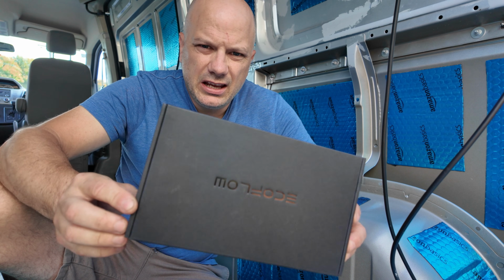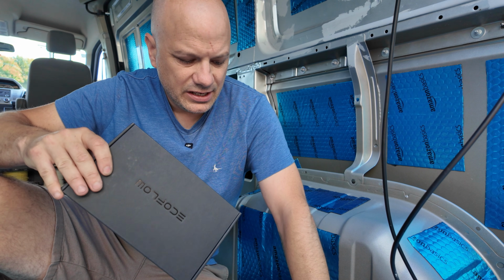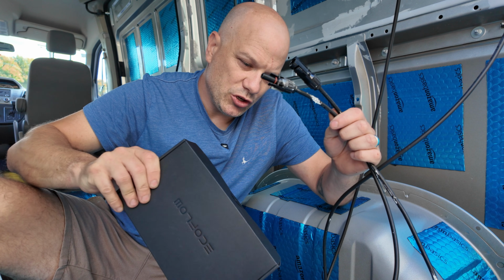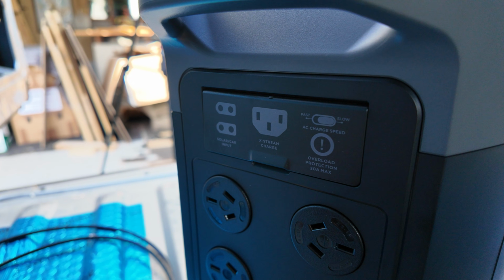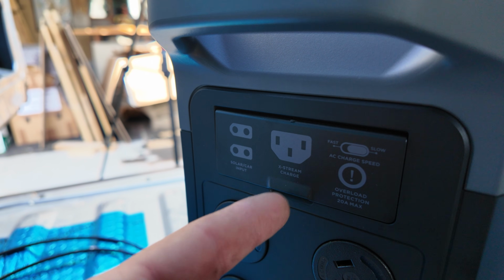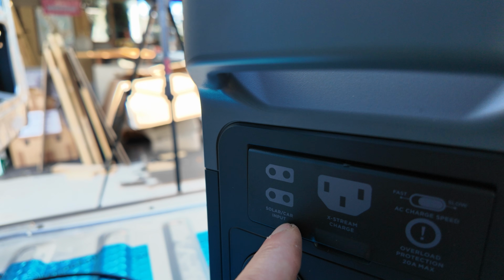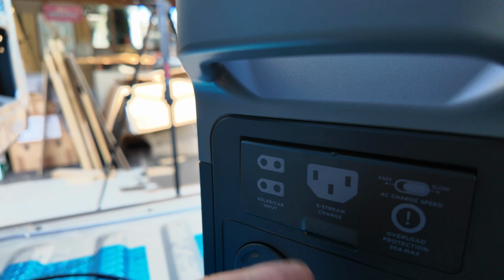So if you buy the Ecoflow MC4 to XT60 cable, what that does, it takes your solar strings, your MC4 connectors, adapts them into an XT60, which plugs straight into the back of the Delta 2 Max. So as you can see at the back here, we've got our 230 volt outlets, but above that we've got a flappy bit, technical term. So we've got 2 solar inputs, so this can actually take 2 lots of solar strings. So obviously the one I've got on the roof is 1 solar string, but it can take another.